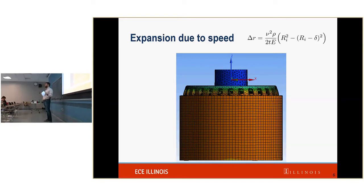We care about this for two reasons. Reason one, as our rotor expands, we increase our magnetic air gap. As our air gap increases, our magnetic reluctance also increases. Think resistance. Magnetic reluctance and resistance are corollary. This decreases our B field, and this lowers our Lorentz force. So essentially, as our air gap increases, the amount of power that we get decreases.